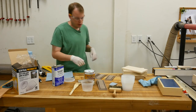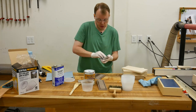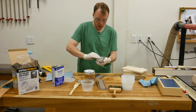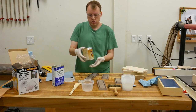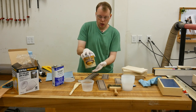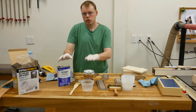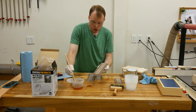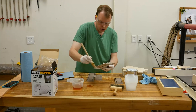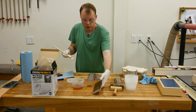We're ready to finish the insides of our boxes. So I've got some 400 grit sandpaper that I've sanded the insides of the surfaces with, staying away from the inside of the miter to keep that nice and crisp. And for my boxes, I like to use Bullseye Seal Coat Shellac. This is a de-wax shellac. It comes in a 2-pound cut. I like to thin that 50-50 with denatured alcohol to give me a 1-pound cut. So now I have some on and we're ready to wipe it on the surface. And it's soaking it up, but there's the first coat on that one.